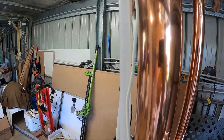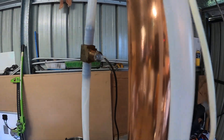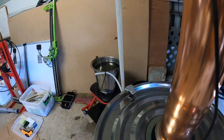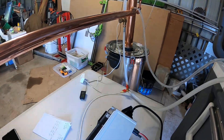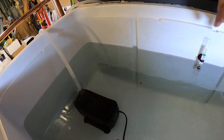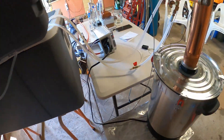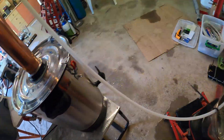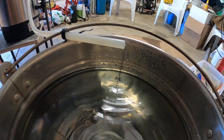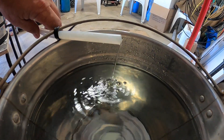It flows back out, and that's where the temperature probe is for the outlet water. It runs into that stainless steel bucket. I'm showing you my double PID controller build and setup — I hope it's very informative. This is the little stream coming from the reflux — just a steady little stream, just enough to give you a little bit of reflux.